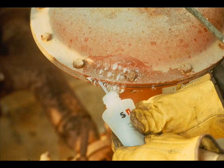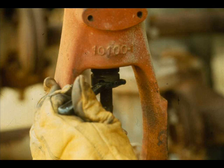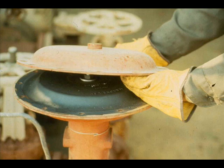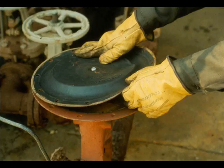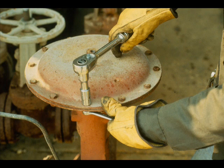Use snoop to find the leak. This leak can be repaired by tightening the case nuts. If air is escaping around the adjusting screw, the diaphragm is probably ruptured and needs replacement. Remove the tubing, then loosen the actuator spring tension by unscrewing the actuator adjusting screw. Failure to release the spring tension can result in a serious accident. Remove the upper diaphragm case, the actuator stem screw, and the diaphragm. Inspect the diaphragm for splits, holes, cracks, or tears. Replace the diaphragm if necessary and reassemble the actuator.